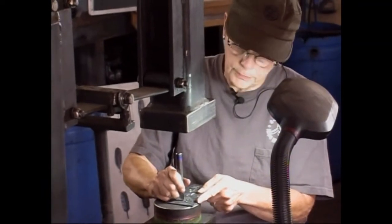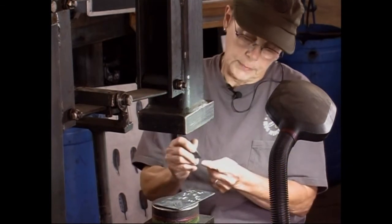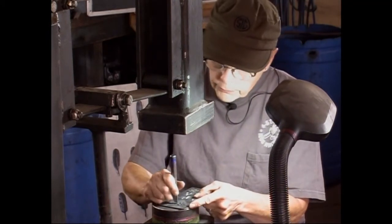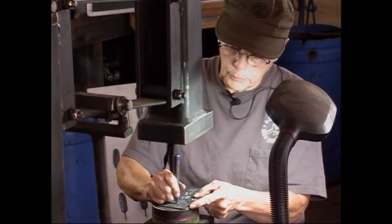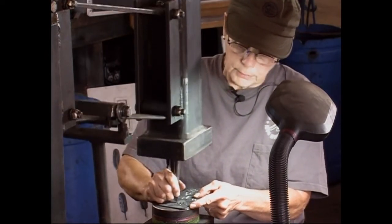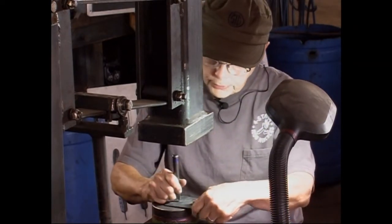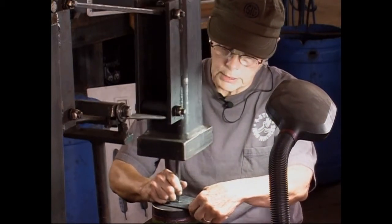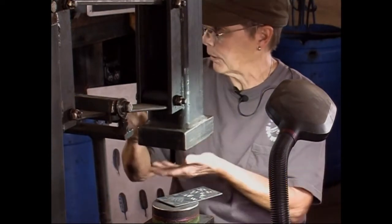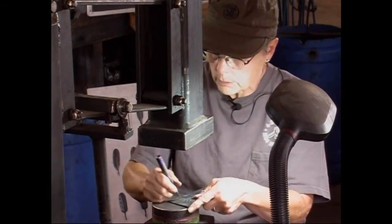After a period of time, you're always holding this tool oriented the same way. Dragging it, you tend to lose part of the metal here. And I have a butcher that is tremendously shorter because it's been dressed so much, but it does happen. Your tool does get uneven, so you're going to have to redress it. To check your tool to see if it is right, aluminum is a great thing because it's soft enough and you can see if your tool isn't hitting right or if it's a high spot or low spot. So just get a hunk of aluminum and play with it.